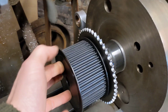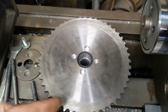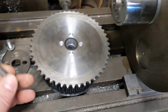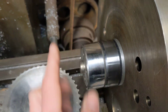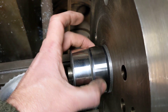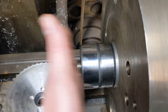The only thing that remains to be done now is to put the four holes into the sprocket all the way through. We'll mark the holes from this side, drill them all the way through, and then from the other side we'll spot-face them so that we can recess the heads of the cap screws and they will bolt the whole thing together nicely. When that's bolted together it locks up these bearing inners, so the drive seal that goes on there keeps the oil in the engine, has got a nice plain surface to run on, and the bearing runs on there. These won't be rotating on the shaft — they'll be rotating with the shaft, locked onto the crankshaft.